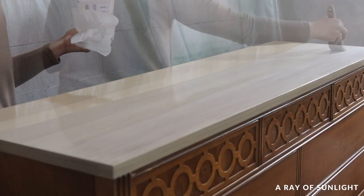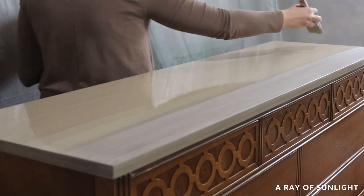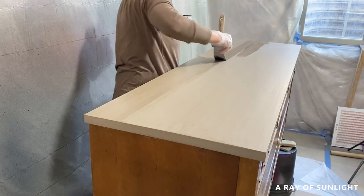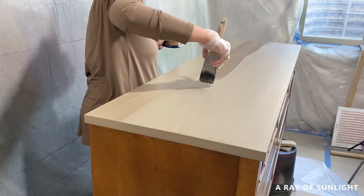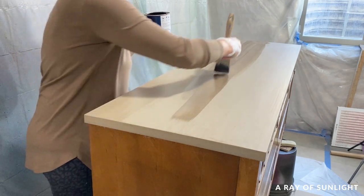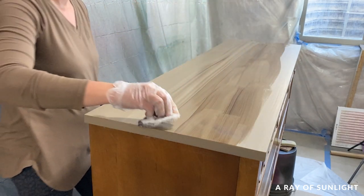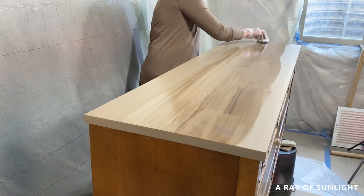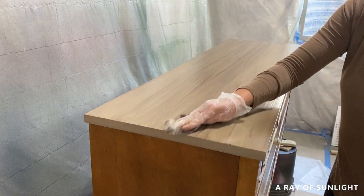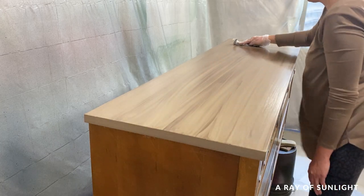I painted a second coat, let it dry, and then I put some water-based wood stain on it. Water-based wood stain is different from oil-based stain — it dries faster and it's more workable, which is a good thing and a bad thing. I ended up going back over it with more stain on the whole entire thing like three different times, all within 25 minutes, before I finally got it looking decent.